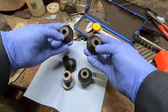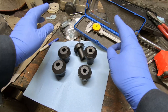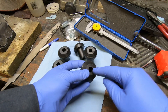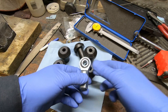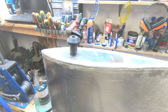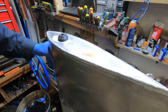So anyway, these are the bushings. I made five just because I expected I'd screw one up, and I'm not super thrilled with this one — the hole is off-center, and they're not perfect on most of them, but that's okay. I'll index them symmetrically so a bit off-center will be fine. What I'm going to do now: these are going to be a pretty tight press fit into the rudder, and then the rod will go through there, also fairly tight. The rod, of course, will move on the rod ends.